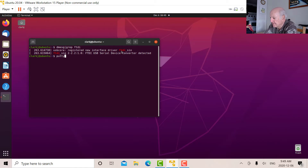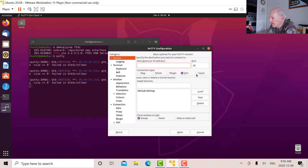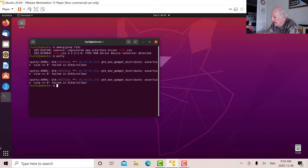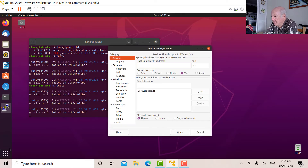The next thing you can do is use the terminal PuTTY. Go into serial mode and the device is called TTY USB0. If I connect that I should see the NMEA data coming out of the Lassen IQ receiver. I made a mistake there — wrong baud rate — so I've got to go back and do that again. We put in TTY USB0 and it's 4800, 8, 1, none — that's what's coming out of the Lassen GPS receiver.